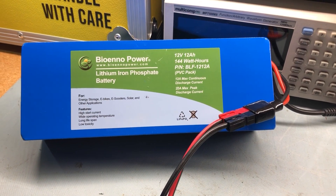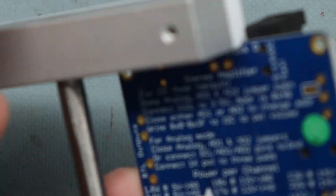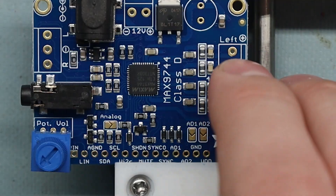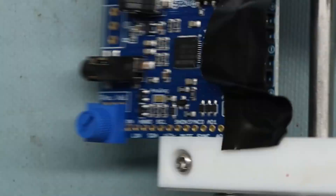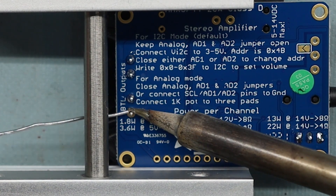I'm going to run this power amp from a 12-volt, 12-amp battery that I typically use to run my ham radio gear remotely, so I know it should run for a significant amount of time. To get the most out of it, I'm going to use a Class D amplifier, which offers high efficiency, trading off some audio quality, which is inherent in Class D amps. The amplifier chip is the 20-watt Maxim MAX9744. The modularized PCB comes from Adafruit — the link is down in the description. This board has two channels intended for stereo operation, but mono is good enough for what we're doing today, so I'm going to bridge the left and right channels at the input and use two speakers at the output.